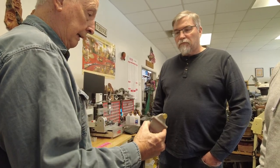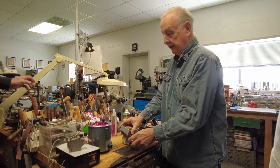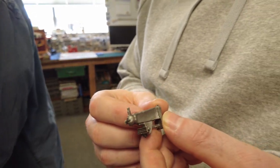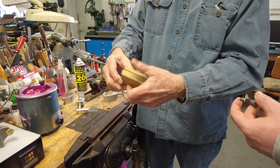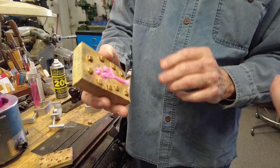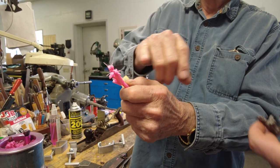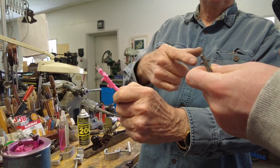I made three or four hundred of these. This up here, you see my line of bridge ports over there? Here's what they looked like when they came back from the foundry. What I do is I leave this thing set up here. In a three or four day process, I will have probably a hundred of these waxes, but this is what I shot just what you all got here. I'll open it up — whiskers, those are vent lines, so when you're shooting the wax up there, it pushes the air out. But you've got to be really careful on this guy to get him out of here, because that little area right there that's missing — that holds the head — that's what got broke off on every one of them.